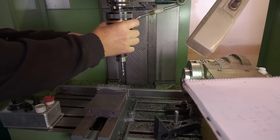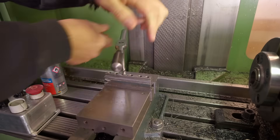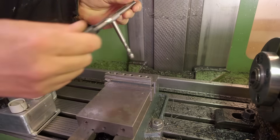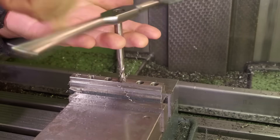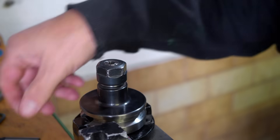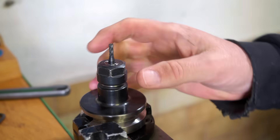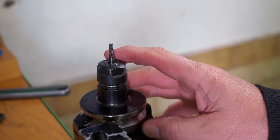Well that worked great. I'll just make sure those are tapped deep enough — first one I've already done. These Starrett tap wrenches are just fantastically made. Beautiful finish. This is a size 91B — it was a gift from a very generous viewer. Fabulous tool to use. I could have easily gone deeper with the tapmatic. I think this tap's cutting beautifully. Now, I mentioned to Stefan Gotteswinter that I'd broken a tap in the work and he said have you thought about milling it out? I was a bit surprised. A T-nut's not really the high value job which justifies killing a four millimeter end mill to rescue it, but on the other hand this is a technique I've never tried, and if I never practice it I won't be able to do it when the important job comes. So this seems like the perfect practice piece.